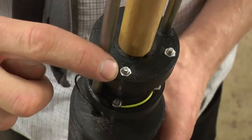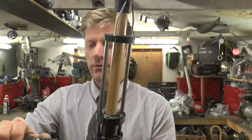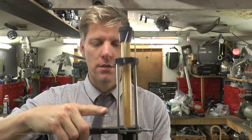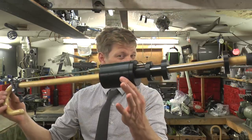Everything looks a little bit like a vinyl record because of the finish on it, but you don't use a tool for what it's not good at - you use it for its strengths. Little things like the slots you can put in, the counters and nuts - I can't do that on the lathe. I probably could have made that bit quicker on the lathe, but I can't do all those other little bits. As for accuracy - got the old calipers here, this was 60mm on the computer program, and in reality it's 60.2mm. I have noticed if you have a 4mm hole you'll need to drill it out slightly with a 4mm drill bit, but it doesn't take much off - just wears the sides slightly so you can get a nut in nicely. Brilliant - 3D printing gets the tick from me. I need to learn the software a bit better but it's a nice simple design to start with.